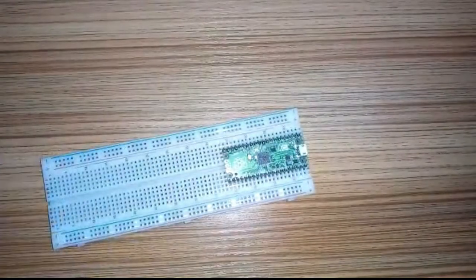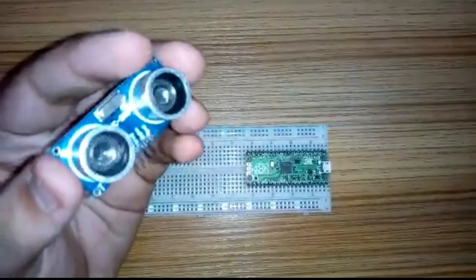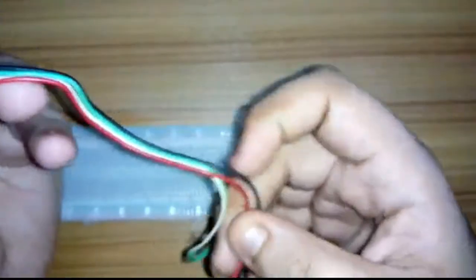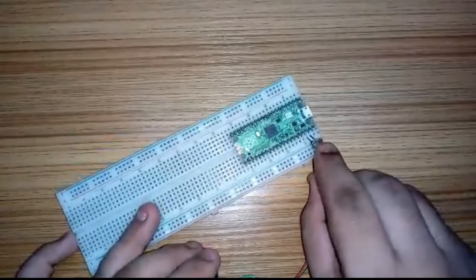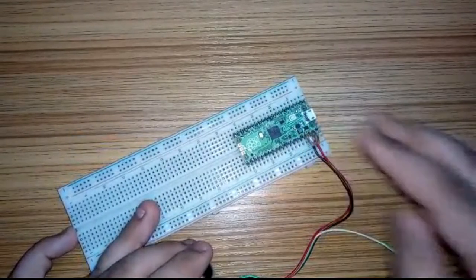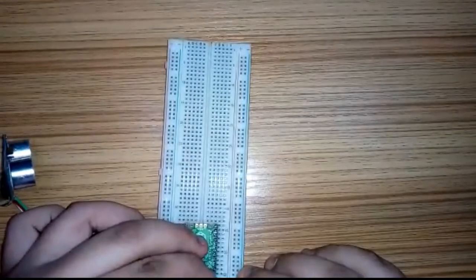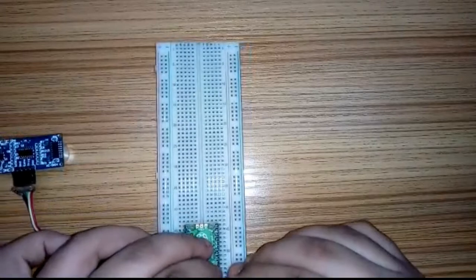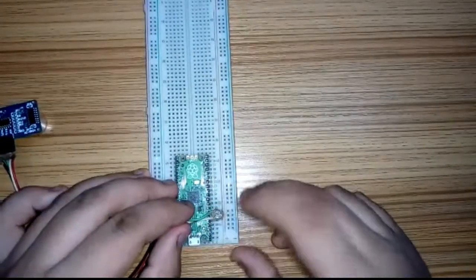First I will be taking the Raspberry Pi Pico and plug it on the breadboard, and then I will take the ultrasonic sensor and connect it along with the homemade jumper wire for making the connection along with the Pico and the ultrasonic sensor. The red and the black wire are the power pins that go to the positive and the negative terminals of the Pico, and the rest two pins are trigger and echo that are connected to pin number 6 and 7 respectively. You will get the link of the circuit diagram in the description down below.